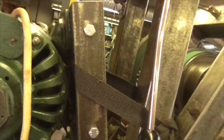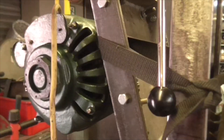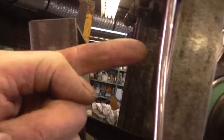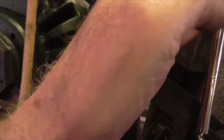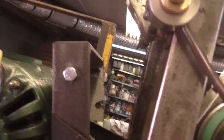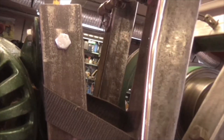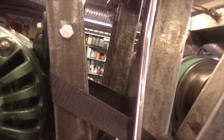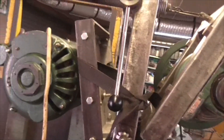The Holbrook - what I've decided to do is to make two pillars to bolt onto these bolts either side, with a round bar on the end like that, with a rubber tube pushed over it, so that it stops against there on both sides at the point where it will just go around. Hold it there with springs - that will be my innermost position where I want the belt not to be driving. So I can't really suss out the length of a belt until I get that done.